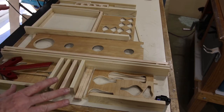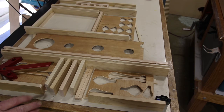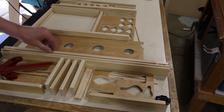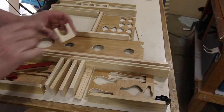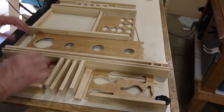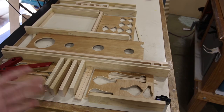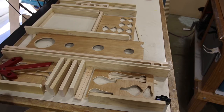So this is all going to be put in the drawer, but an important part to talk about is that none of it will be glued or screwed down. The reason for all of these different pieces is this whole assembly will lock itself into place. And this morning when I took it apart, for example, all I did was take out this one piece, and that made it so I could lift up one piece to start with, another piece, and then they all start coming apart, something like dominoes. And that way, if I need to make changes, I buy a new tool, or I've decided the way I've set it up doesn't work quite right, I can easily change it just by pulling the pieces out without having to tear apart the entire drawer. So let's say we go through a mock assembly process and see what we get, okay?